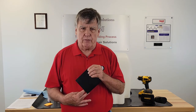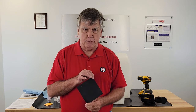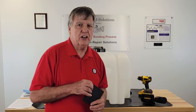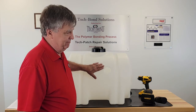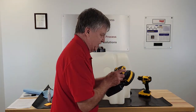The first step in applying the patch is surface preparation. The patch itself has already been prepared. This patch is what we call the XT patch. XT patches are braided on one side and glossy on the other — it's the braided side that goes against the tank. Surface preparation of the tank always starts with roughing the tank to below the sheen. Almost all polymers have a sheen to them, and the key is to rough it up to below that sheen.